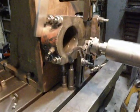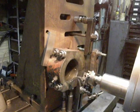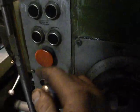A little bit of my experience: I will use 100 RPMs and I think 0.2 millimeters per pass. At start I will move the cutting tool by hand.